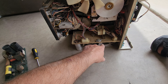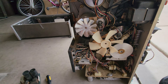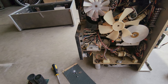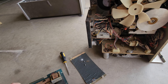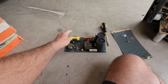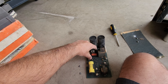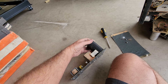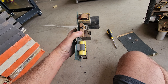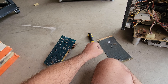There are other caps on this thing I've got to be concerned about — there's a speaker cap here and some other caps below it that need to be changed. Here's the power supply: when I plugged this thing in and powered it up, this resistor was getting hot like crazy. It's got two can caps with another cap down there, and these are completely dried out. I think I'm going to rebuild this power supply.